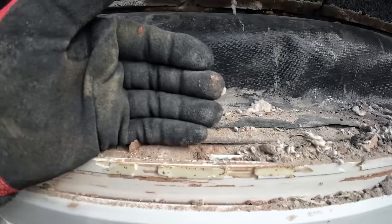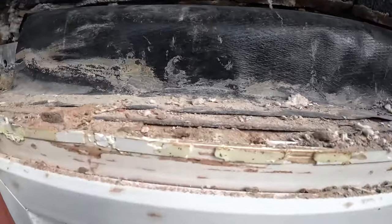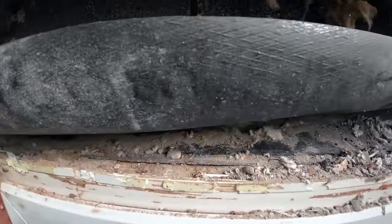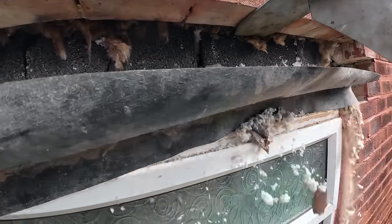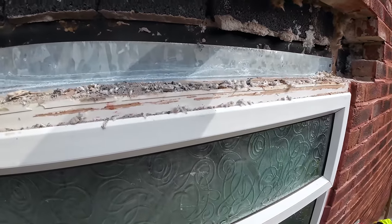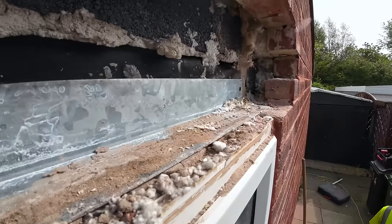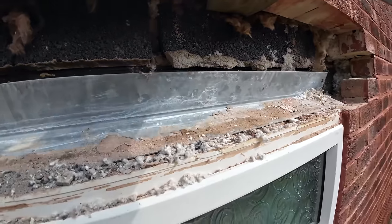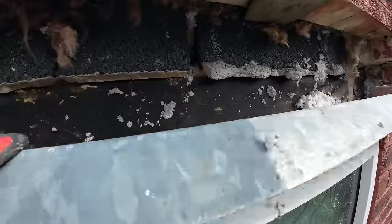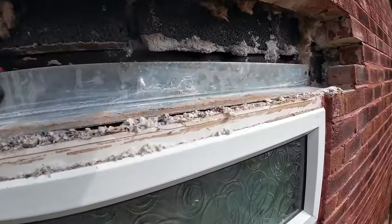any water just got trapped on the sand and cement and either worked its way to the ends or into the frame. The tray wasn't secured in any way. It's the right lintel, but they just put it about half a mile back because we'll be reusing this.